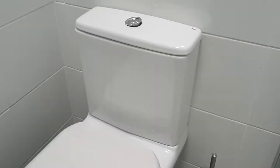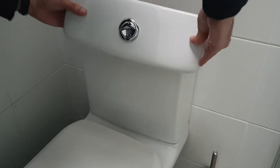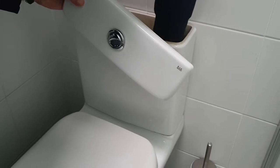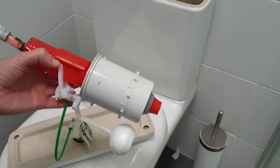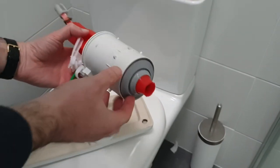The water tap is down the side there. Okay, so the water's off. Take the lid off and put my hand in — I'm just going to turn that center section and then it unclips. So here is that center section; I just twisted it and it comes straight up and straight out.